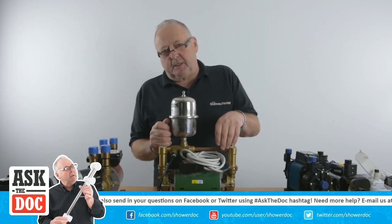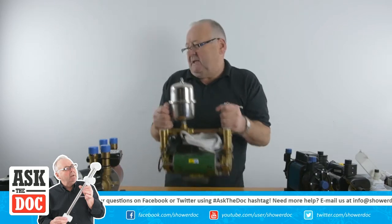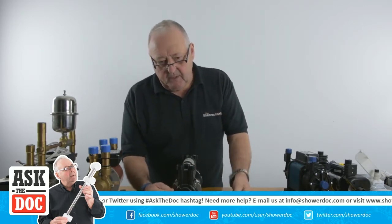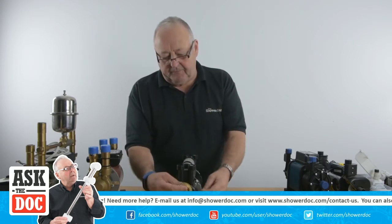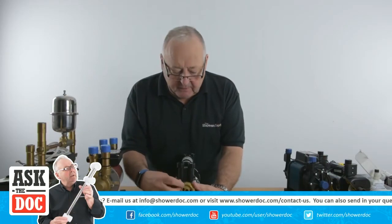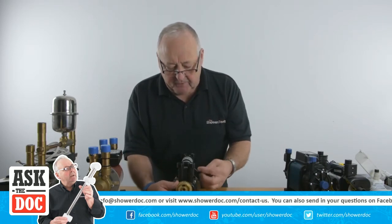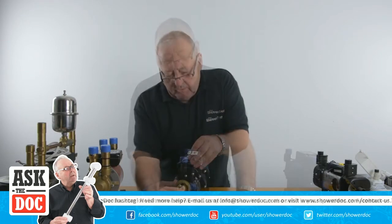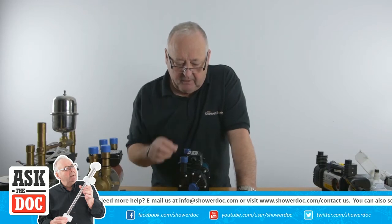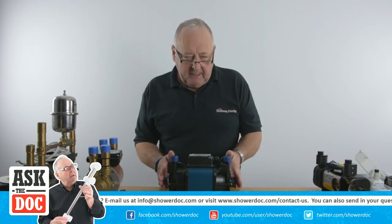What we really need to do now is discuss the two normal methods for a pump to work. This is a regenerative pump. What happens is the water comes in and then we have the impeller, and it fits in here. As the water goes in, it spins and it grabs just a tiny little bit of water, spins it round, and the force of spinning it round shoots it back up and out the other side. With the centrifugal type, the water goes in the centre, gets spun round, and gets thrown out the outlet pipe. It's a fairly simple thing, but this tends to be quieter.